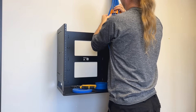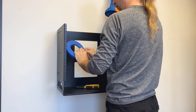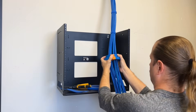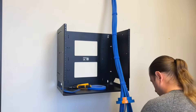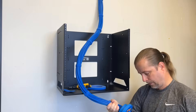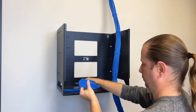About every 10 to 12 inches, I will use some Velcro to keep this in line. This is a lot easier with a friend to help you, but it's not that hard by yourself. If you do not have a cable comb, don't worry about it — you can do this by hand, it's just a little more effort. But if you go slowly and untangle the wires as you go, it's not a problem and you don't need this tool.